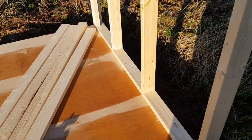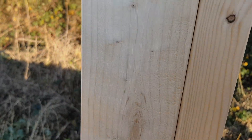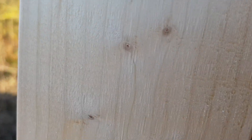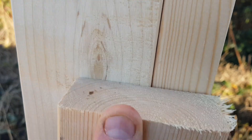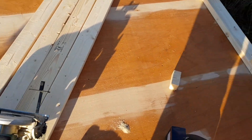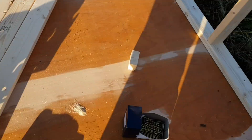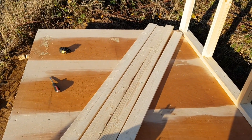It's a nice calm day and this wall went up fairly painlessly. As I was on about before — you put a 4x2 like that which represents the thickness of the next wall, and you've still got a piece on the inside to mount a board to. Got these bits ready, just need to cut four six-foot lengths for the two ends, top and bottom.